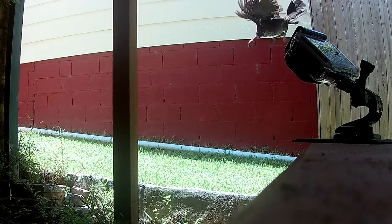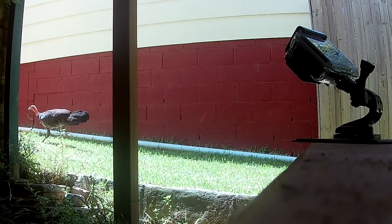We had something telling us this was a bit of a turkey of a pressure chamber. That wasn't an ideal result but that's obviously why we do these tests. The good part is it didn't fail in a major way — only a small leak. What we think happened is the inner fiberglass lining of the end cap delaminated, the carbon fiber had a few small holes, and that caused the leak. It could have delaminated because I didn't sand that inside smooth surface, and it may have had mold release on it. Next time that surface has to be prepared properly.